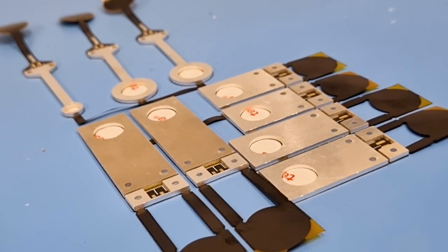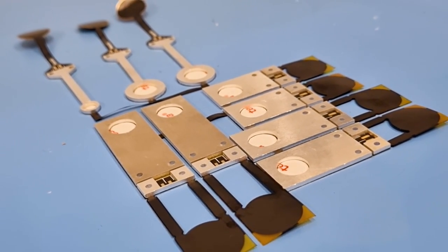For the new samples, I decided to use a larger 10 mm diameter flat magnet which stayed flush with the aluminum stiffener. It also provided a larger contact area with the adhesive, making it more difficult for the magnet to get disconnected.